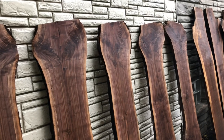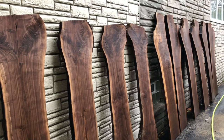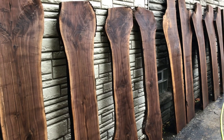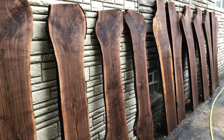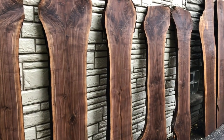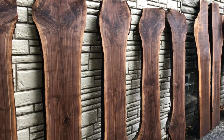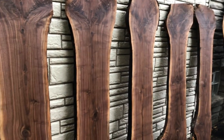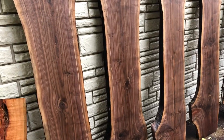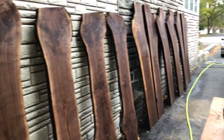That's the gist of it. It seems kind of counterintuitive, but this has proven very well for me in getting a jumpstart on inventory, getting all the old sawdust off, getting them clean so there's no chance of mildew. It will stain — if you have a nice maple and a clump of sawdust sitting on there that's wet, in a week you can have a mildew stain that will go all the way through the slab. It's insane how quick that can happen. I've been bit by that, so I'm kind of gun shy about it. Clean them off, get an idea of what you got — that is step one.